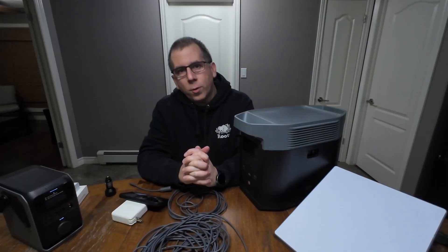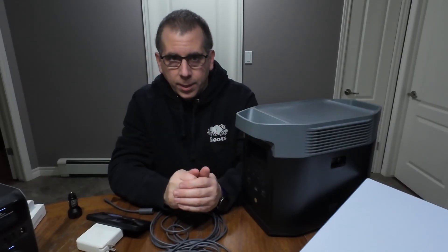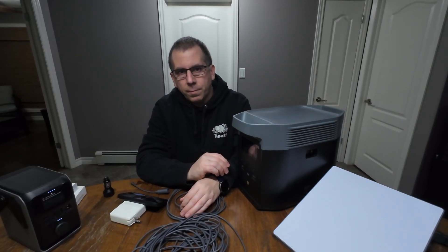First, let's go over what my setup is and how I use my Starlink just to make sure we're on the same page. I go camping for several days in a row, and in each of those days I will power my Starlink for 14, 16, maybe even 18 hours in that day. To power my system, I use an EcoFlow Delta II. The power output that I use is USB-C, because it's DC and it is one of the most efficient methods of delivering power.